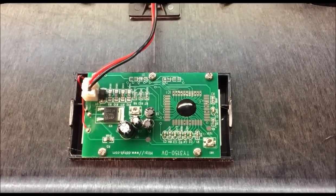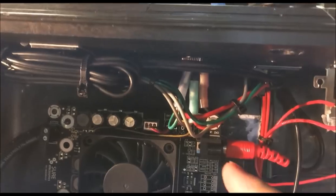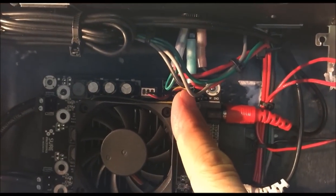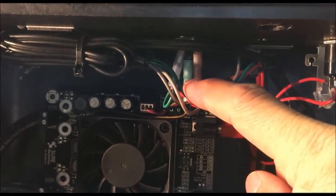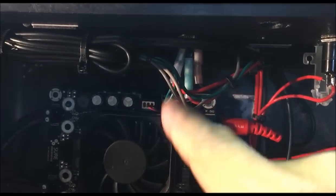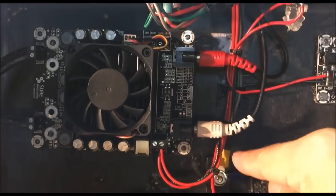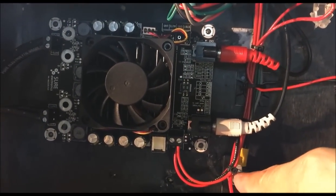I also have this voltage display. Following the wiring, there's a gray wire that goes all the way up to the middle plug, which is the switched 12-volt output. The other gray wire simply goes to the star ground at the bottom. Star ground is really important here.